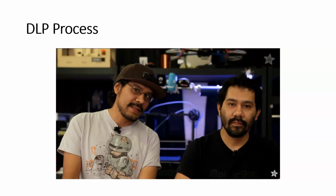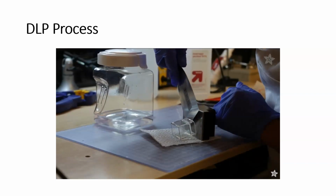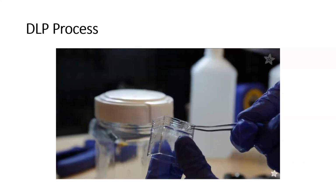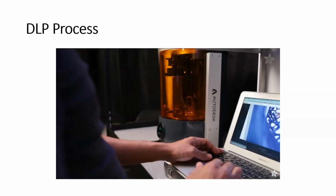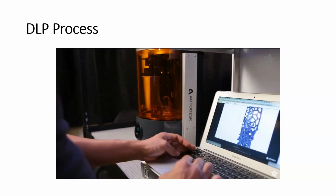When the UV light is exposed to the resin, it's hardened and solidified. The resin tank then separates and moves away from the build plate and then returns for the next layer. And it does this for every layer. Enclosure parts that are smaller than 30 millimeters can actually print without any support material. STL models themselves are going to get prepared using Autodesk's Meshmixer, and here you can set up your support structures to hold the models to the print head.